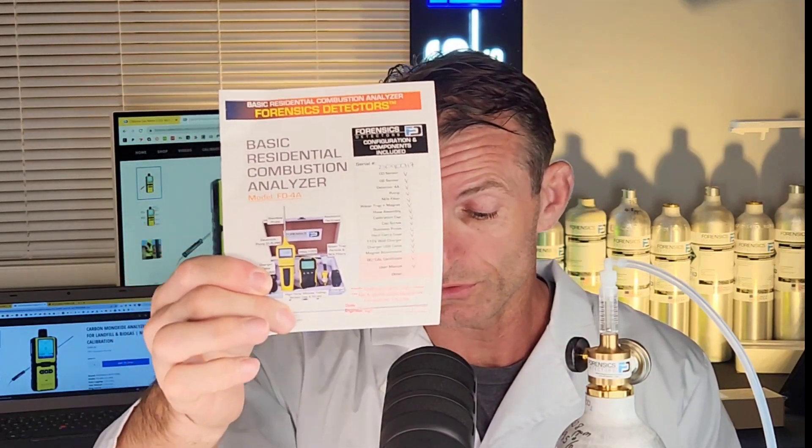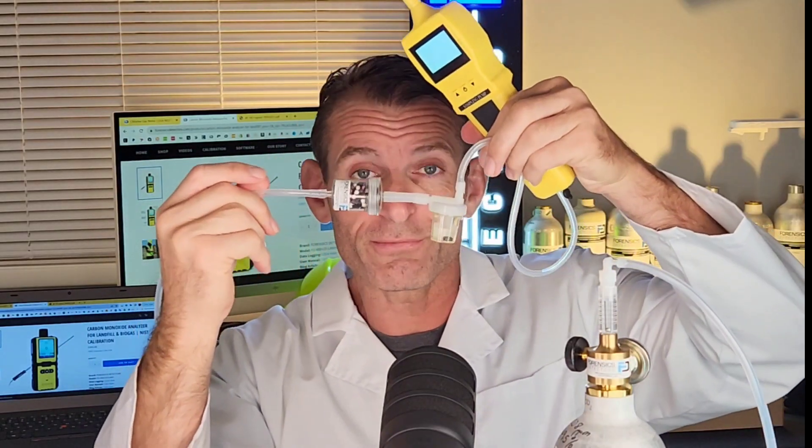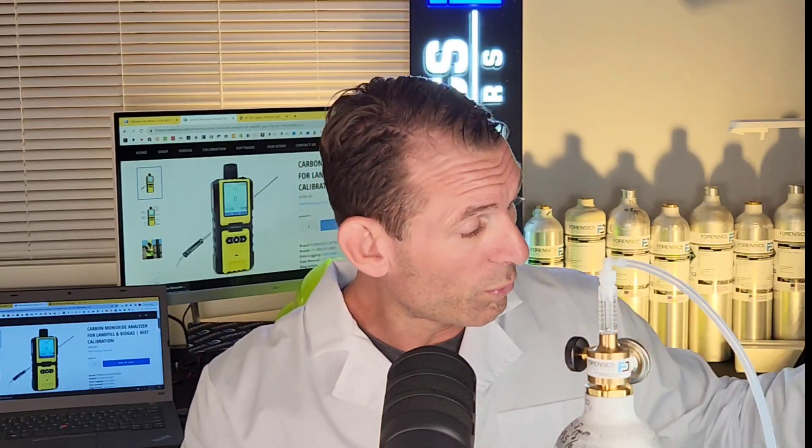Let me show you what you get. You get a nice box, and within it comes the user manual — a very nice color booklet. You get your USB charger, the wall charger and adapter. You get a NIST calibration certificate to assure you that we have calibrated the unit here in Los Angeles, ensuring quality control and calibration — you want to make sure it's giving you the correct calibrated numbers. You also get the pump, the probe and nipple at the top, the combustion filter setup with the tubing, and of course your analyzer.